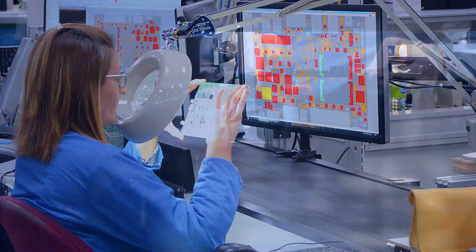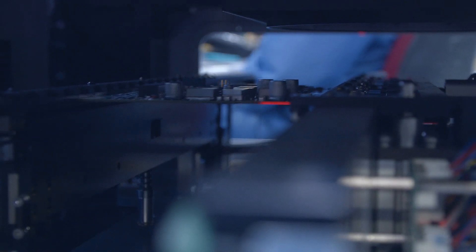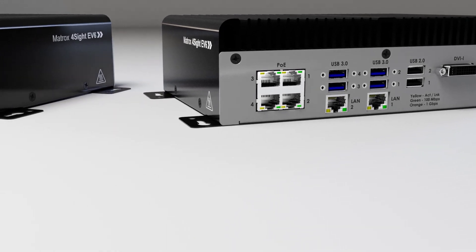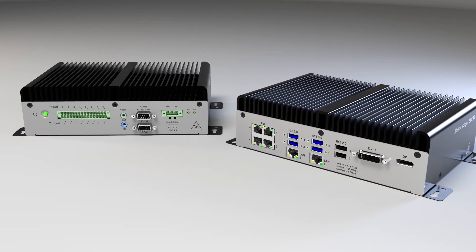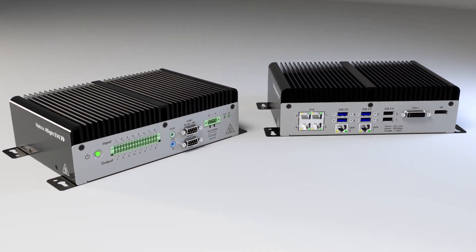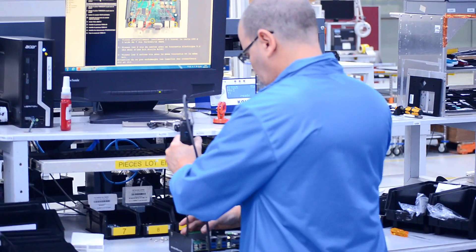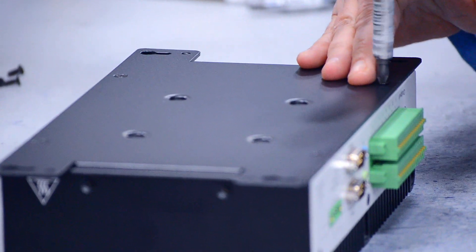Manufacturing aside, what else can you tell me about the transition from the GPM to the EV6? What should customers know about the new version? The EV6 now integrates a 7th generation Intel Core processor that provides the computational power needed for more demanding multi-camera and even multi-line inspections. We also have real-time discrete IOs powered by a dedicated hardware system mechanism, enabling output events to happen at very precise moments in time. Finally, we built the Foresight EV6 with the same form factor, connections, and size as the GPM, and we made the software portable so that the system can be upgraded easily.